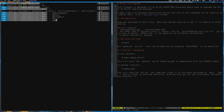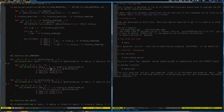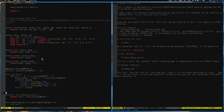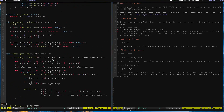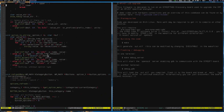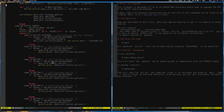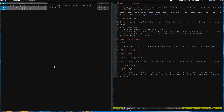The second most interesting file is probably spectrogram.c, which does all the drawing of the nice display — draws all the lines, graphs, and the waterfall. I've also got the lookup table and the coloring code that colors the waterfall nicely. You can change the dimensions of the spectrogram and other things there. Then there's menuDialog.c, which encompasses the menu system on the right — it has all the logic that renders text properly, detects button presses, and calculates option values. It actually works on top of an abstraction I've created and declared in options.c.